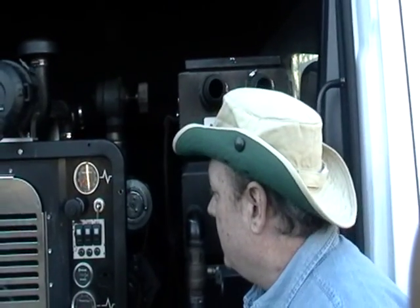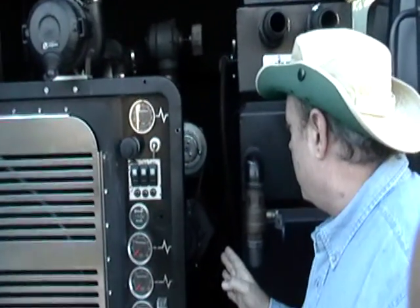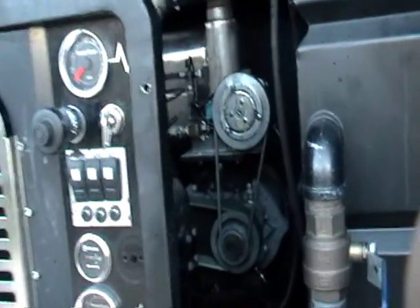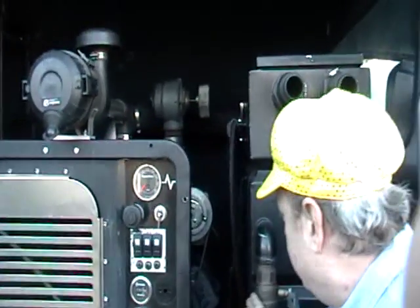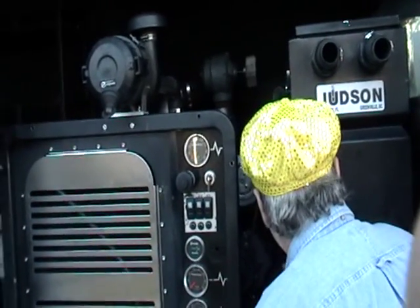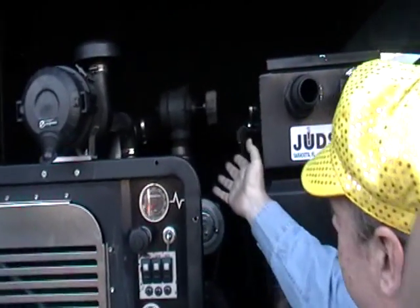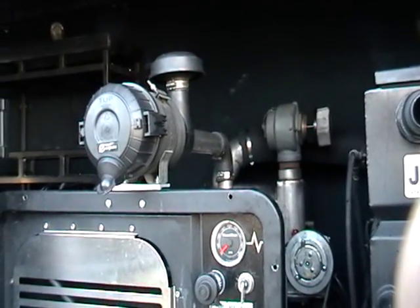He saw the video I had done on the Blue Line thermal wave where we converted it, and we got that machine running at just above idle — so that engine should last forever. The main thing with the heat was that when you go high flow on commercial applications, it would not maintain high temperature. The blower was an 850 CFM blower — that's the 5.9 — and the CFM was 850 CFM. The relief valve was basically bypassing all the air because when the wand's down on a carpet, it can only get about 200 CFM at most because it's semi-stopped up with wet carpet.